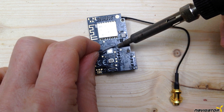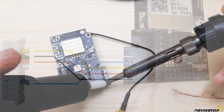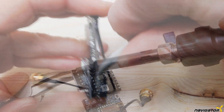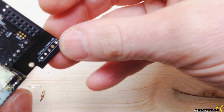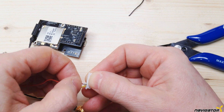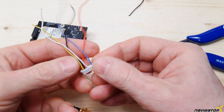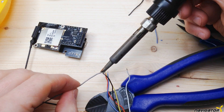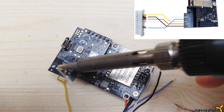This is what the modified crossfire transmitter module looks like. In this chapter, we solder the connector to the module according to the schema. First, the existing plug is detached — remove solder, remove plug, remove pins. Ideally you will see the holes where we simply push the cable through and solder them. We recycle the 11-pin connector. The cables have to be extended, or you use new cables with the fitting pins as I do here. The color choice is arbitrary. The cables are pre-tinned, dipped in flux and soldered according to the schema.